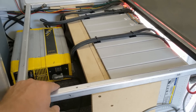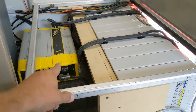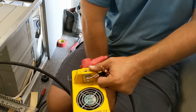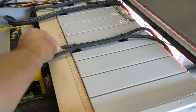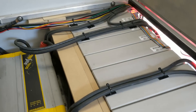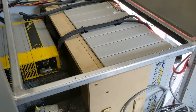Today is the next day — a windy one. The inverter was installed temporarily last night just so we could get by. This morning I got 2-gauge welding cable and ran two leads for positive and two for negative in parallel. Everything has been zip-tied down, all other cables are zip-tied in place, and the batteries are super firm.